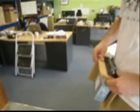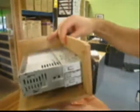Your sauna also comes with an audio deck. Slide the audio deck into its holder like so. Remember those cables you fed through the top of your sauna earlier? Find where those are hanging and attach them to your audio deck. Both the black component cable and the multicolored wires connect to the back of the unit. Once they're connected, line up the holder with the pieces of wood on the side panel and screw it together through the four pre-existing holes in the audio deck holder.